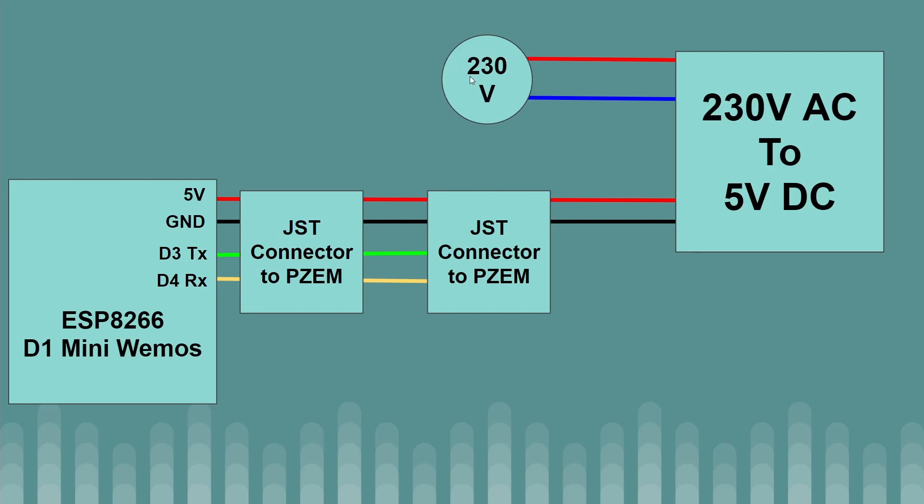So how is it wired up? It's a very simple wiring diagram, but it covers pretty much everything. First we have our 230-volt AC input feeding into our AC-to-DC transformer. The 5-volt output from that connects along the same PCB track, going through the PZEMs and then to the D1 mini — same with the ground — so one transformer powers all devices. The RX and TX serial communication lines connect to the adjacent pins, which makes wiring very simple as you're only using four tracks to connect everything.